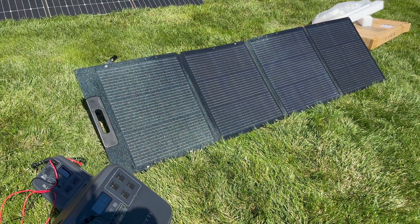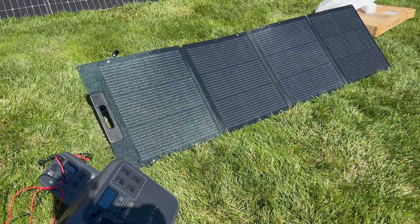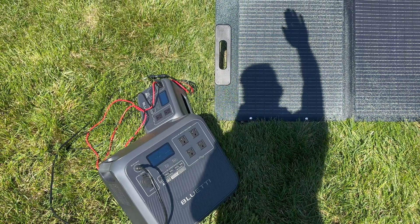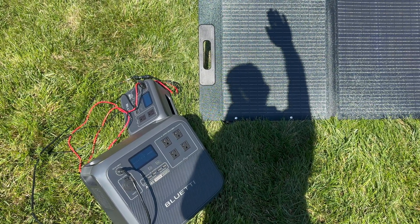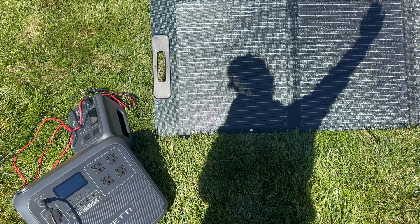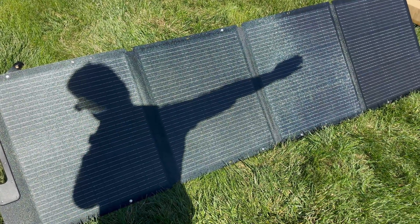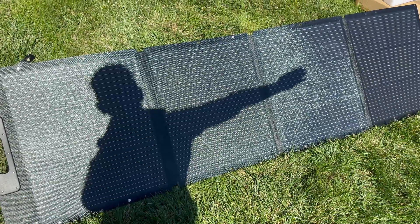Here's some more impromptu testing. A little bit of clouds moved in up high — the AC-180 is currently bringing in 154 watts on this panel. Let's do some shading tests. I'm blocking one panel — 124 watts. So we went from 150-something to 124. Now if I extend my shading to a second panel — yeah, that hurt it: 92 watts now. Can I broaden myself to partially shade three sections? 85 watts with a significant part of partial shading.